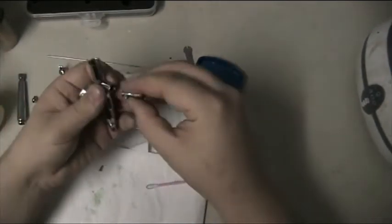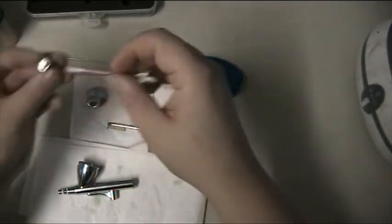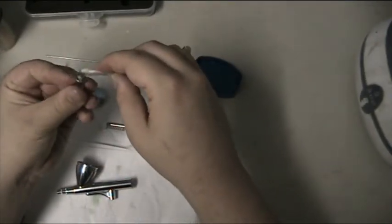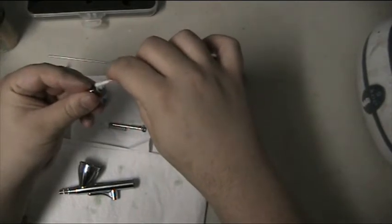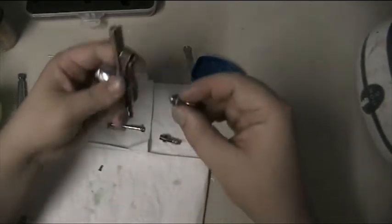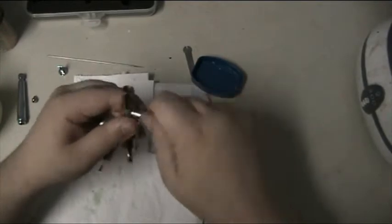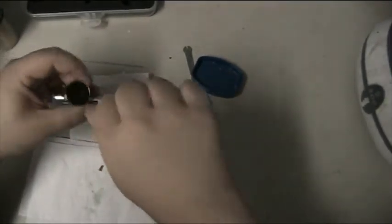Now, with the internals, the first we deal with is the air solenoids. So that part is already greased up. Grease up the other end. The lubricant also, when it goes in the thinner, does protect the rubber washers. There are some rubber washers, even though the rest are Teflon. Then we put in thinner there, and we, not thinner, lubricant.